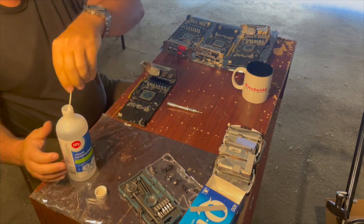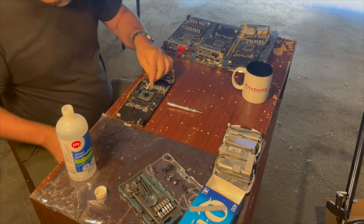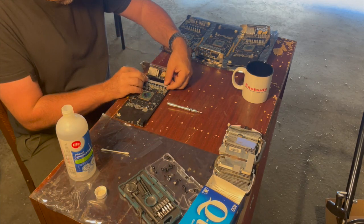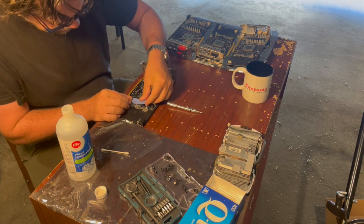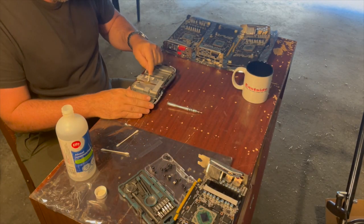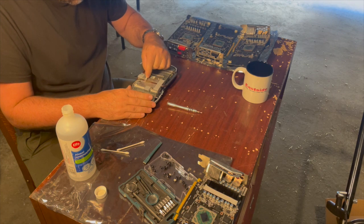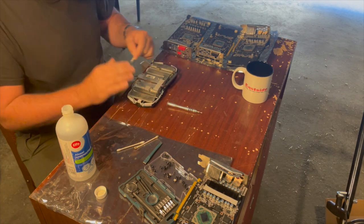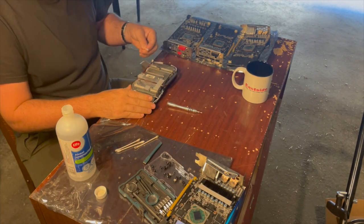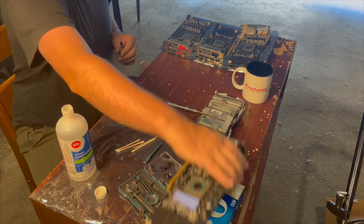Back at my place, I'm putting the cards back together. There are lots of videos showing how to reassemble these cards. I'm cleaning off the chip again with isopropyl alcohol before applying thermal paste, and putting all the pads on. If you have a lot of cards, or even if you're just buying used cards here and there, I would definitely recommend an ultrasonic cleaner. It's super easy to use and the value you get out of about $500 worth of equipment is incredible. I think it should definitely be part of any mining farm's equipment.